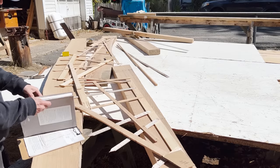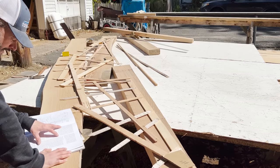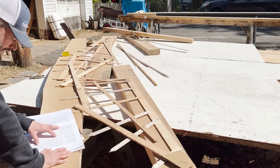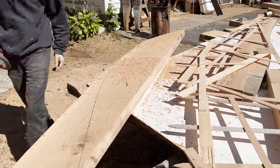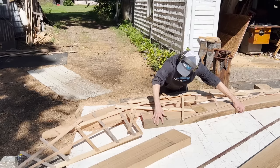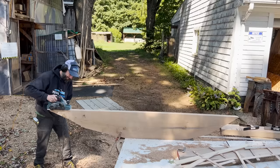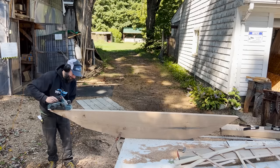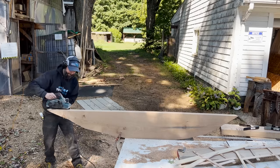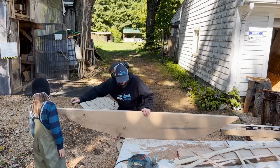And if we consult Bud, I trust that the above has put you in a proper frame of mind to appreciate the other kind of rudder, hung outdoors for all to see, vulnerable to attacks by pirates, and terminating the length of the vessel in a no-nonsense lack of overhang. Now find the best piece of oak that ever grew on the cold hillside, a plank sawn from near the center of the butt log, blue in color, with interlocked grain and a tough, mean look about it. Joint one edge of this plank absolutely straight, lay it in waiting until you've installed the gudgeons on the transom and the stern post. And that is what we have here.